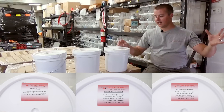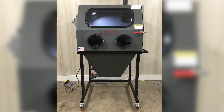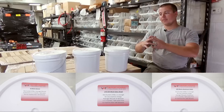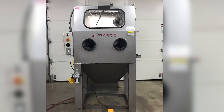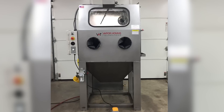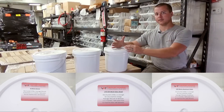The poundage does go up depending on the model. The weekend warrior 800P series and the Ergo 750 all use 25 pounds. If you go to the 1000, it uses 30 pounds; the 4000 and 3500 use 35 to 40 pounds of abrasive. You have measured volumes to go off of.